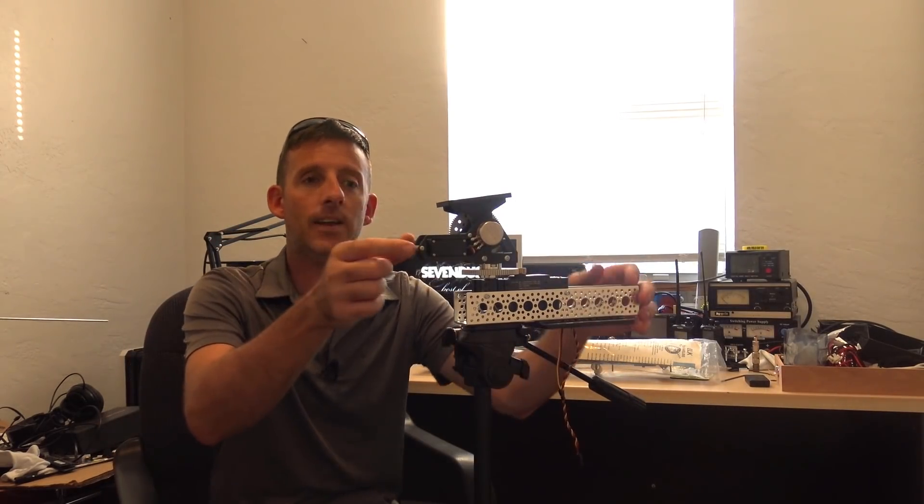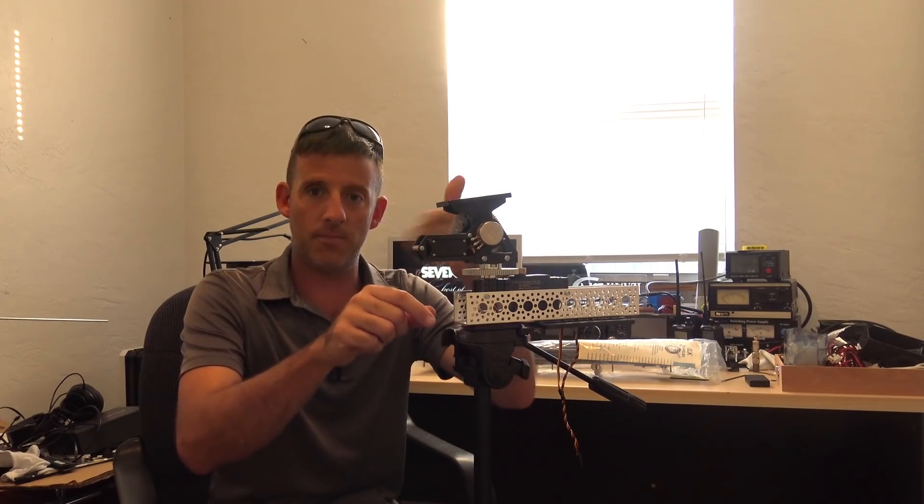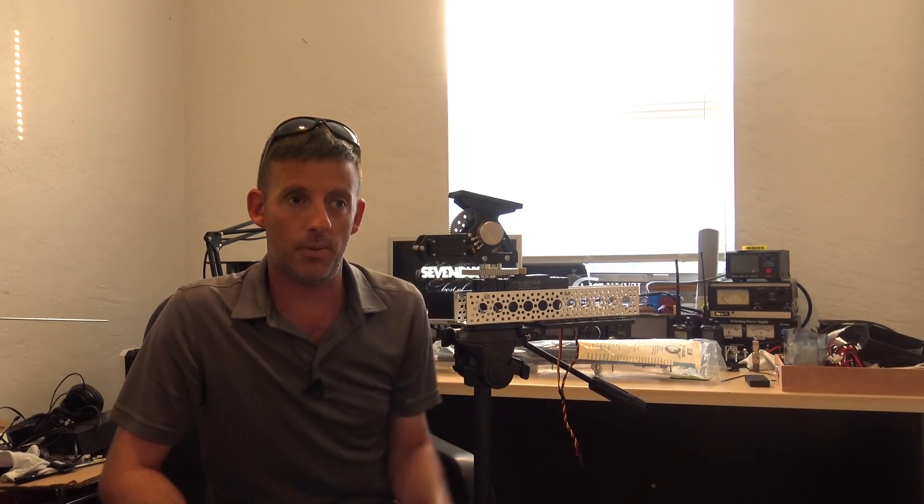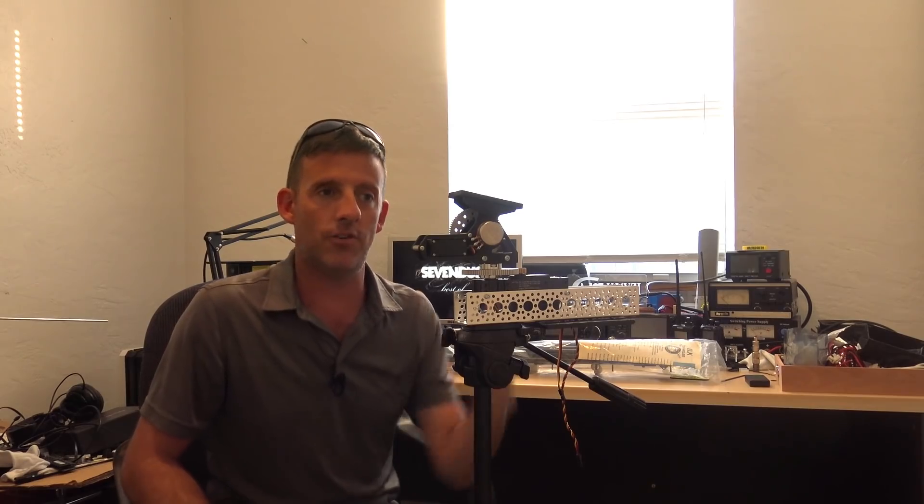What I did was I picked up another antenna. This was the last dilemma for the last few weeks or a month or so, because the antenna I thought I was going to use for this is not going to work on my tracker. The tracker has a servo for azimuth and elevation, up and down. The problem is this servo was not strong enough to hold that thing in a certain position — I tried to mount it, played with it, and it just fell right down. It didn't have the strength for it.